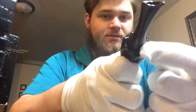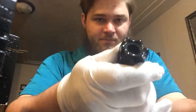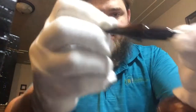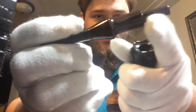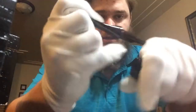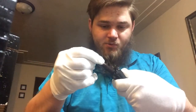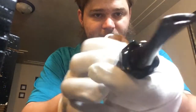And in order to make this part work, I needed to have some free area in the middle. So I made a second mortise inside of the ebonite. And so this looks a little bit funny, but it has a good reason. This part actually is the tenon, and this part is just adding a little bit of stability into this mortise. I didn't want to have a 2-inch long tenon unless somebody breaks it off. So that's how this pipe works. As you can see, it tapers down to a very thin mouthpiece.